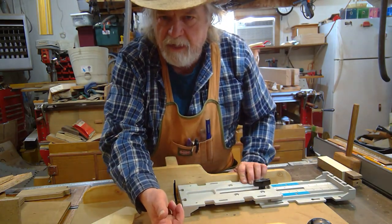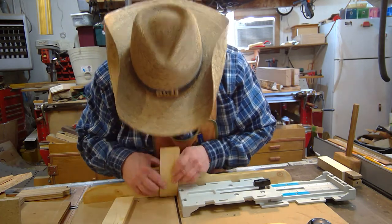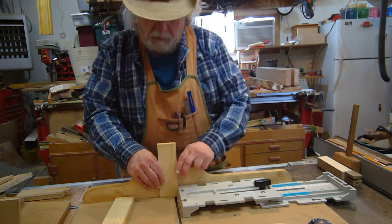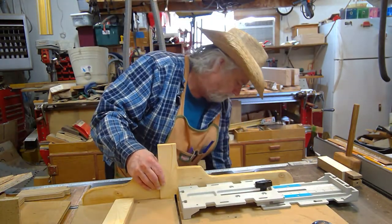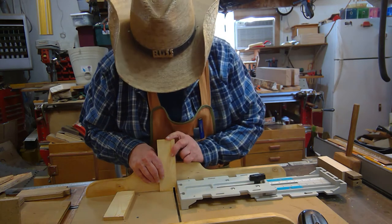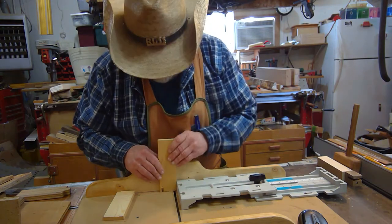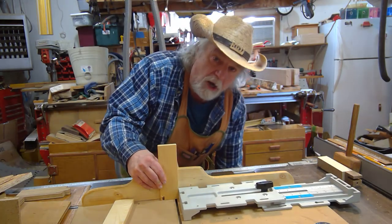That gives me a half-inch to the right-hand side of my blade. We put this piece in here — the first one — and let's cut the finger to create that center finger first on this board. Now that I have it cut on this side, I just flip it around and we're going to cut on the other side the same way. Then I'm going to hog out the rest of the material.